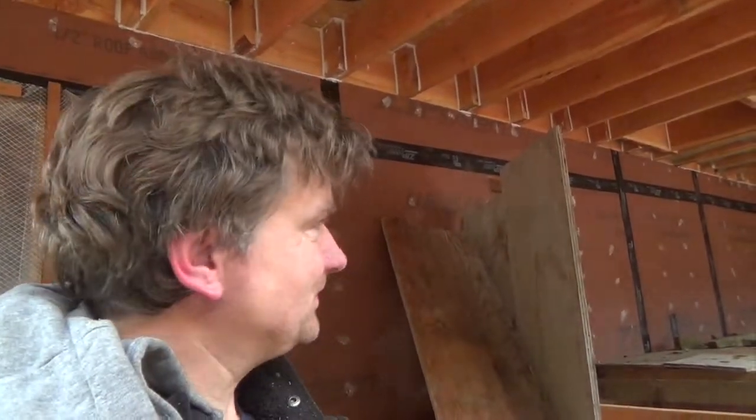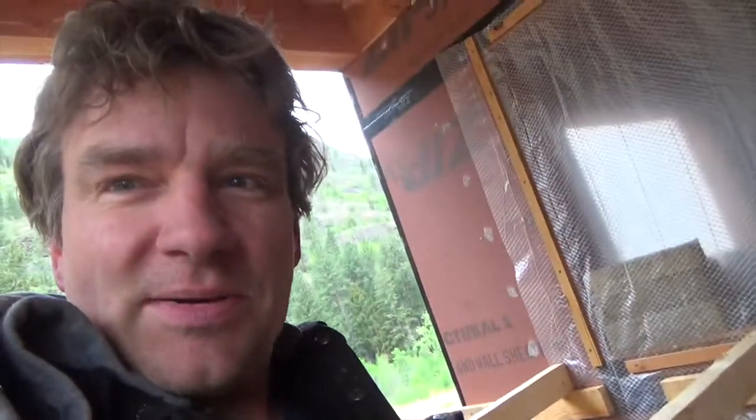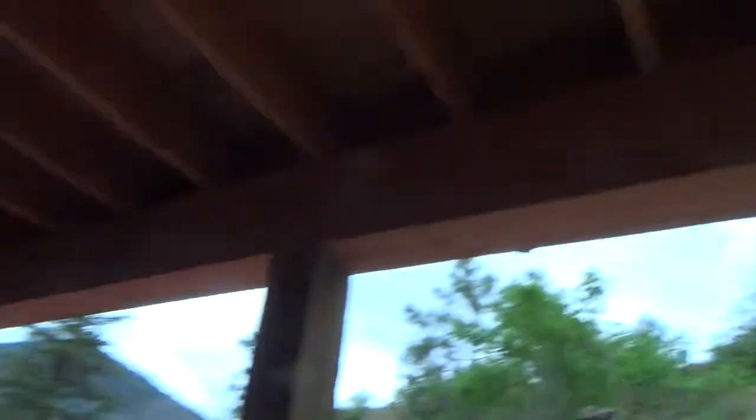They are on 24-inch centers — it's just a work platform. I got a bunch done. I'm all the way to the trap door with insulation and caulking. You can see where I stopped and can probably figure out why. That is why they don't make lumber out of ponderosa. I'm going to feel this in the morning. I've got some other studs and I'm not actually going to swap out the ones that have already proven to hold me up. The goal: get this all the way insulated at least to where the wiring comes through, and then get the back side of that log painted — pump caulk into those cracks and paint it. It's on the list.